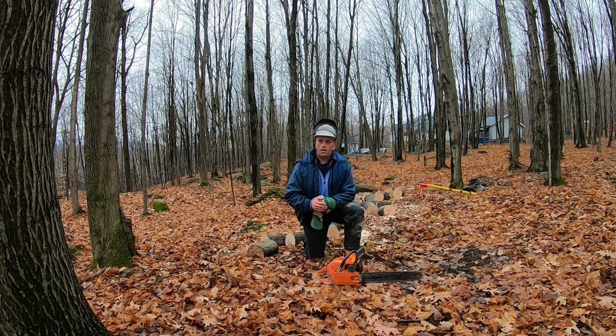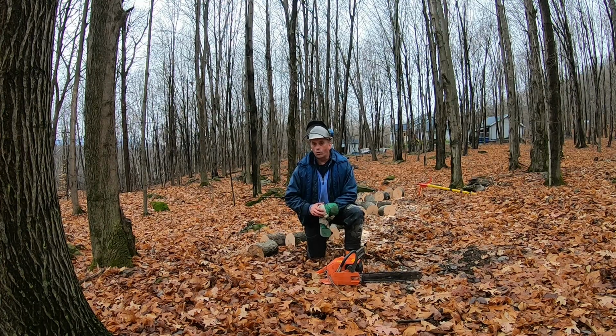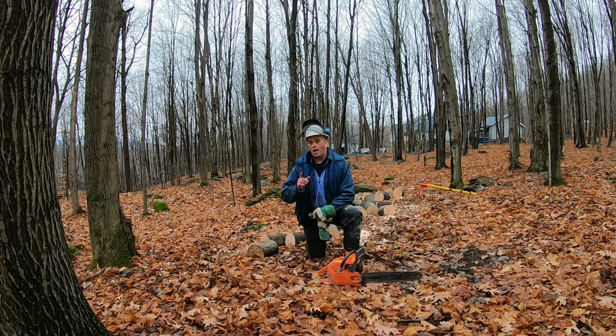It pays to sharpen your chainsaw, obviously. But what I would like to say is, if I log all day, which is rare, usually I log in the morning and in the afternoon I pick it up, because as I was getting older and maybe smarter, many accidents happened to me. It was always in the afternoon with the chainsaw because I was getting tired. So I log in the morning and I pick up in the afternoon. However, what I do is I sharpen my chainsaw twice a day. I start with the chainsaw, everything clean, everything good. I go log. At lunchtime, I clean the chainsaw lightly and I refile with a very light sharpening, so it always cuts well,